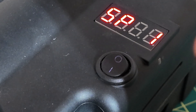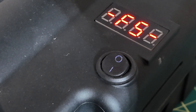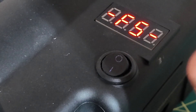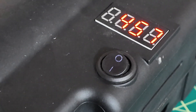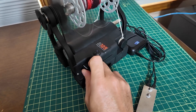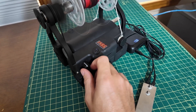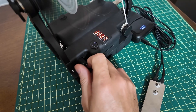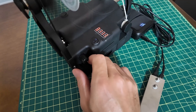Profile one is the full speed mode, and profile two is the open loop version. You also saw the voltage displayed there for a minute, and now it's waiting for me to press the foot pedal to start spinning. So here at about half speed we're at 1500 RPMs — which is what the other profile maxes out at — and if we continue going, we've got over 3000 RPMs at maximum speed.